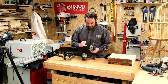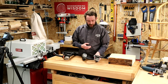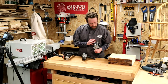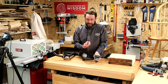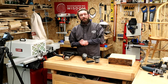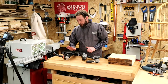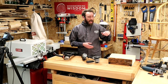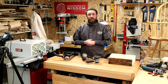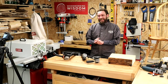All of these grinders have the same kind of spindle on them with the same thread, and they seat really nicely. You usually get a couple of black plastic bushings to sit and balance the blade properly, or center the blade onto the spindle. But yeah, the industrial wood carver, the turbo plane there, and lots of the mini versions, they just fit straight onto the spindle of any 4.5-inch grinder. Okay. Perfect. Good stuff.